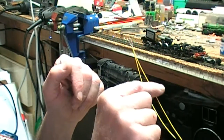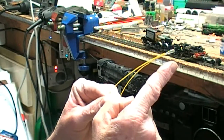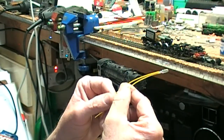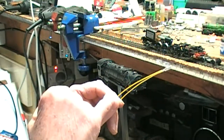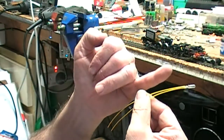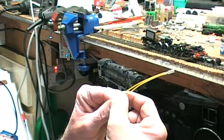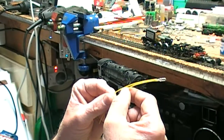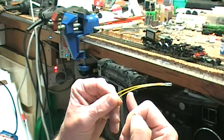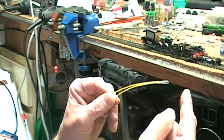Into here I'll be splicing a diode on one of the two legs so it only comes on in forward mode. There's also a capacitor — a 100UF capacitor — to go across the positive and negative pair. The capacitor will act like a rechargeable battery: it'll power the globe and act like a shock absorber, picking up fluctuations of power so the globe runs at a steady constant pace. There are a few different ways of doing this and I might cover that in another video.